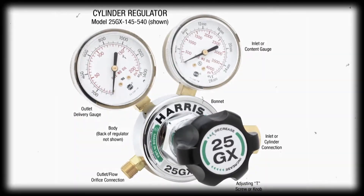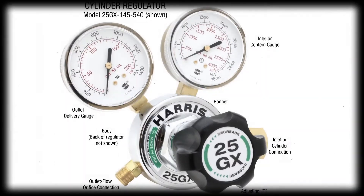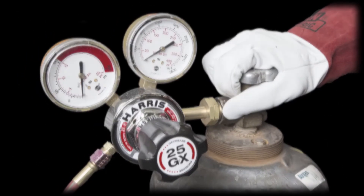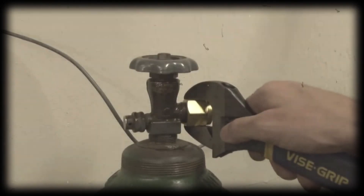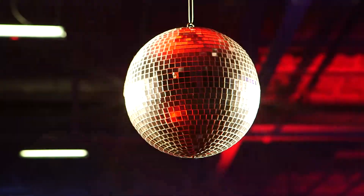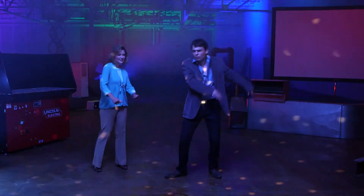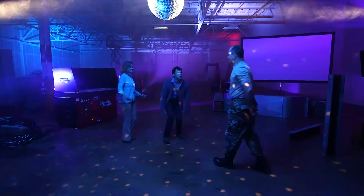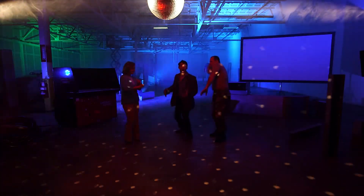Don't use regulators or pressure gauges from an oxygen cylinder on a cylinder containing fuel, or vice versa — this could cause a mix of fuel and oxygen in a place you don't want them mixing. Always turn off your torch, regulators, hose, and cylinders when not in use. Regularly use a soap and water solution to check threaded connections at the torch, hoses, and regulators to be certain none are leaking. In summary: read the instructions, follow all safety precautions, keep your tools and gear in good working order, maintain and clean them regularly, develop safe work habits, and never cut corners.